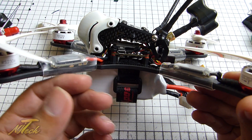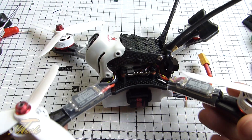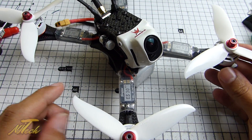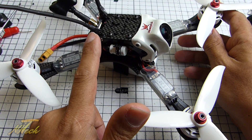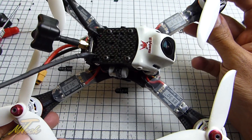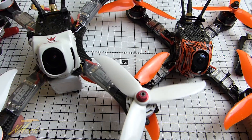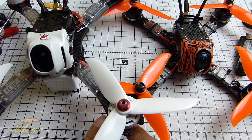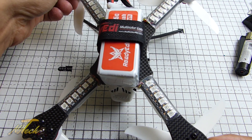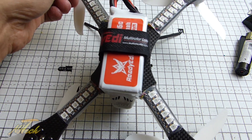I know I could have gone with the Betaflight standard LED control system — there are some good effects like the Larsen scanner — but the ones programmed into this chroma kit are absolutely fantastic, and I'll show you those patterns in just a second. The Monster V2 is all programmed up and working absolutely fine, as is the Betaflight OSD. Smart audio is working a treat, so I can switch power and channel via the Betaflight OSD, as well as PIDs and other useful things. There's a quick look at it next to its brother the Beast X — you can see the slight difference in geometry with these arms a little further forward and closer together. With it flipped over you can see how those LEDs look underneath the heat shrink, and the wiring is tucked partly in the heat shrink and then up and over so there's no wiring in the way of the battery.